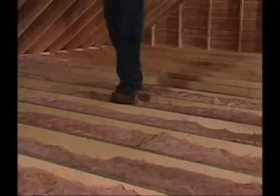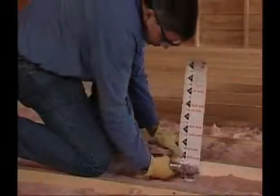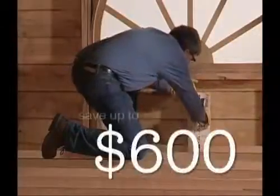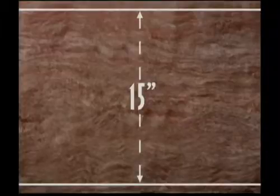The first thing you need to do is figure out how much insulation you already have. Measure the thickness of your attic's existing insulation using an insulation ruler. To help save as much as 28% on your heating and cooling energy bills, it is recommended you should have 15 inches of batt insulation.